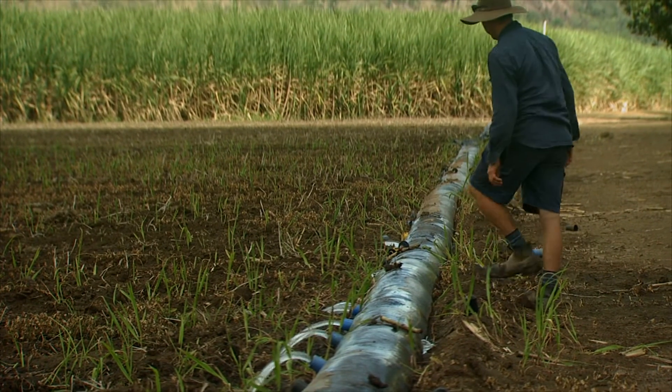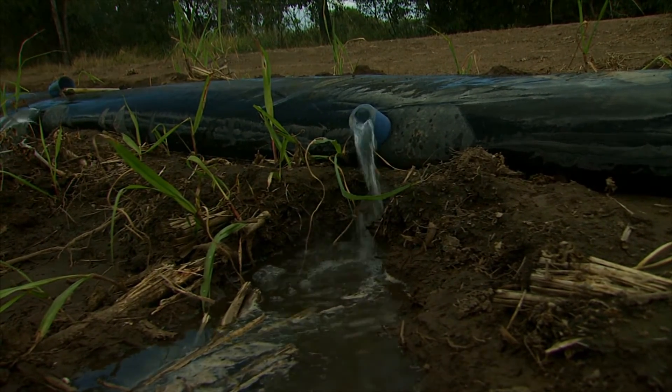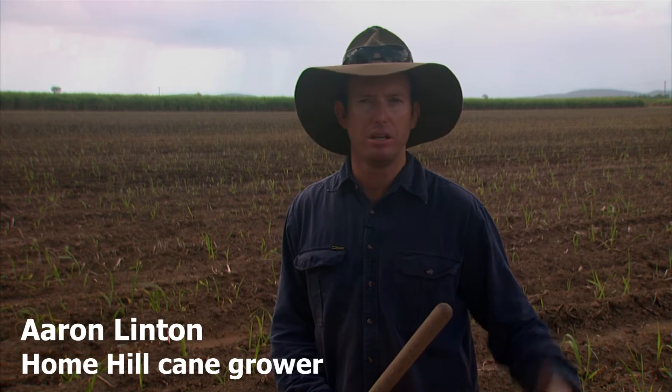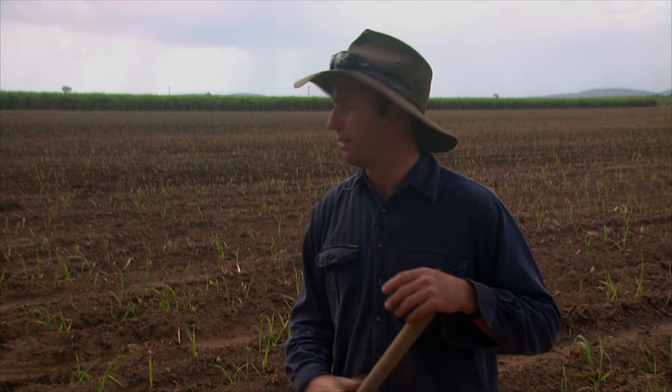It's then a matter of working out how that stacks up against the increased electricity cost of pumping water through the drip system under a higher pressure than what's needed for furrow irrigation. I've got roughly two hectares of drip tape that I'm putting in here, and I've got two hectares of flood irrigation which I'm using over here. We're going to compare all the information — the inputs and the outputs — and just see what the yield is like, the energy use, the water use, and any other benefits or pros and cons, and put it down on paper so we can come up with a proper business case scenario comparing apples with apples.